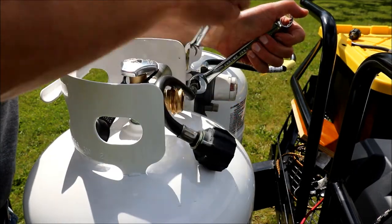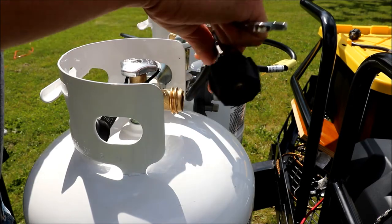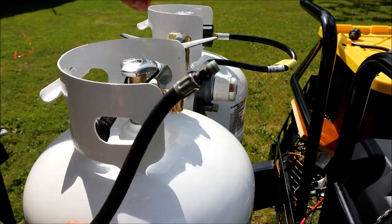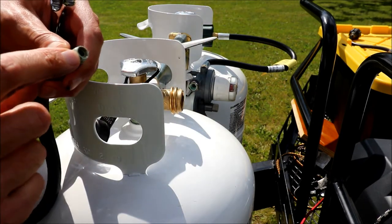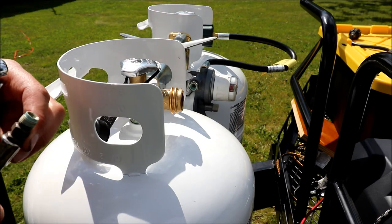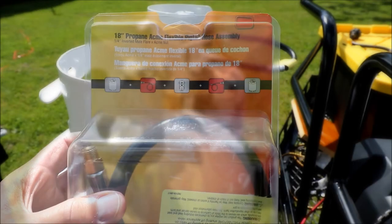You can see this one is absolutely covered in sealant — it looks like the right type, a green sealant, but this fitting is inverted and cone-shaped. They go together on the inside, so I don't understand why thread sealant was applied here. These also don't look like pipe thread; they're just straight threads. So I don't think that's correct.